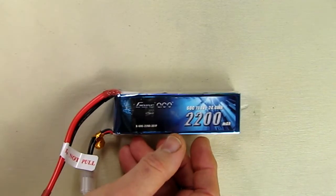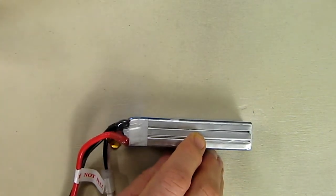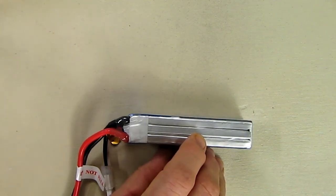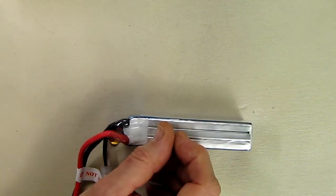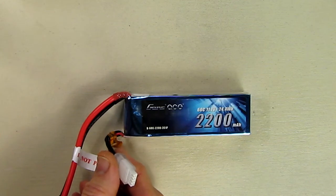Let's talk about this battery in terms of size and weight. The internal structure of the lithium polymer battery is made with superior Japan and Korean lithium polymer raw materials, which is good — there are a lot of knockoffs out there, so this is the real thing. It should have a long cycle life of at least 150 charge-discharge cycles, and 200 watt-hours per kilogram in terms of energy density. The balance port I mentioned is a JST-XHR port, which is pretty common these days.